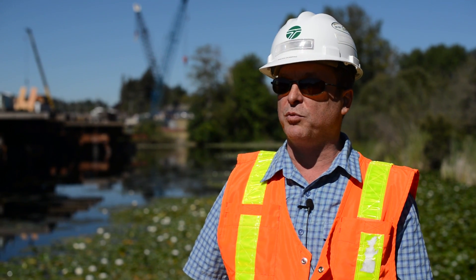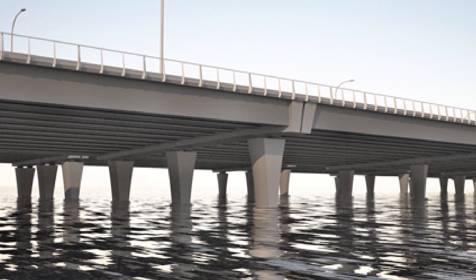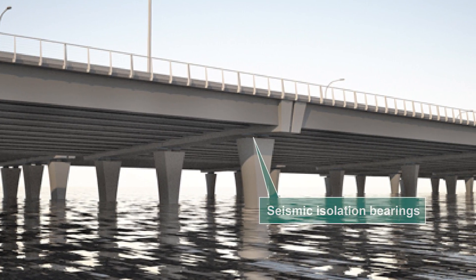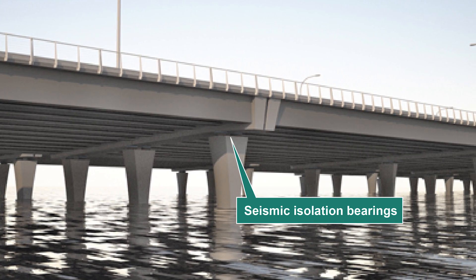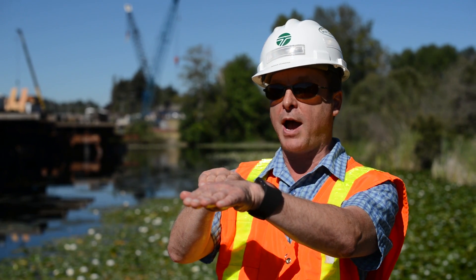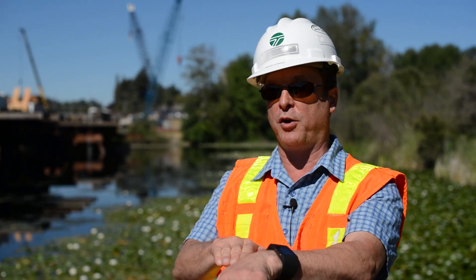What's also unique is that the girders don't sit directly on the columns. They're going to sit on these things called seismic isolation bearings. That allows the five different spans of the West Approach Bridge to move back and forth together during an earthquake. And then when an earthquake stops, wherever that is, we're able to jack those things up, center them back down, and lower it back down.